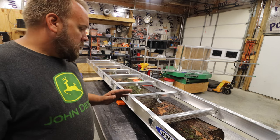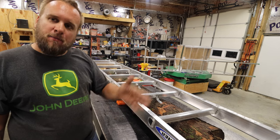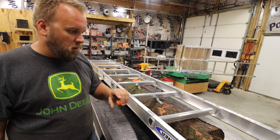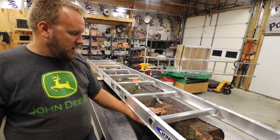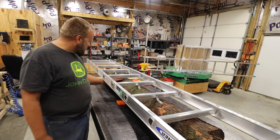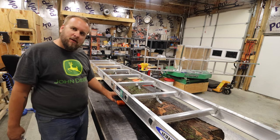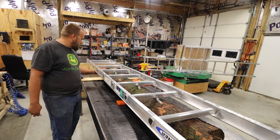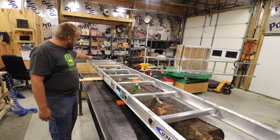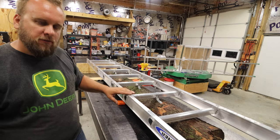So the ladder is 3 inches thick. The instructions on assembling the mill have me put it together and set it at 4 inches. So I've got this 3 inches, and then the screws are short, so nothing should be 4 inches. And there's even a little bit of gap between the log and the ladder at this end, maybe a quarter of an inch, because it's being held up by that piece of wood. That's gonna give me more of a flat log after the first cut.